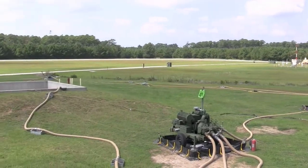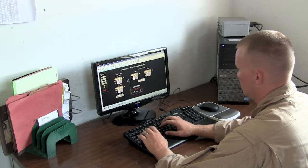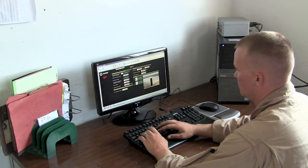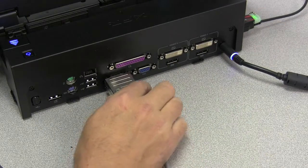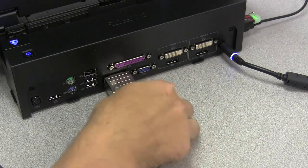Refer to the TAC fuel system manual for guidance. To start, ensure that Fuels Manager is operational and ready to start the mapping process. Then connect the cable coming from the TDU to the TIC and connect the TIC to the Fuels Manager PC. The system is now ready to be powered up.